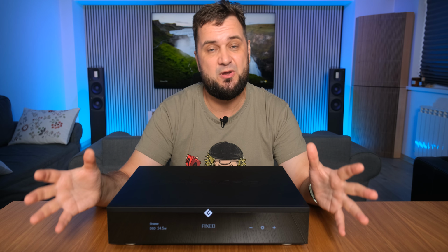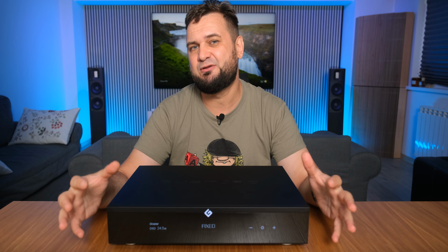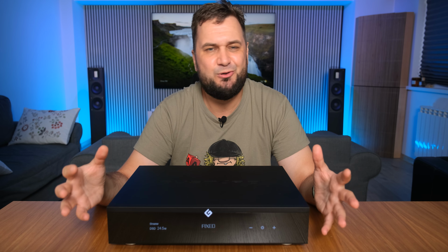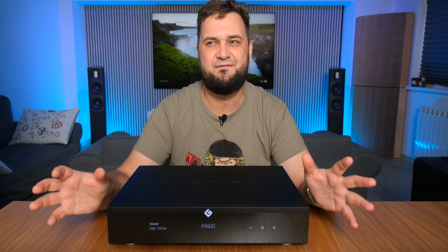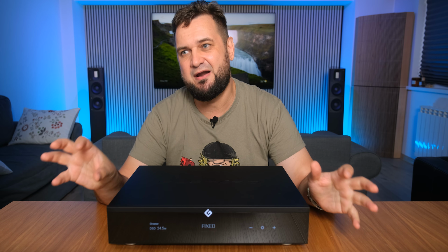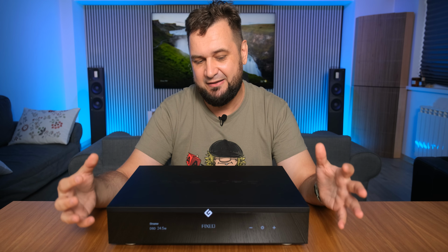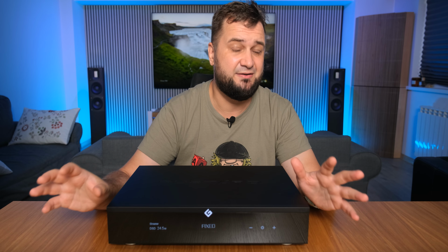While we're still dealing with an oversampling Delta Sigma DAC, which is the X30, don't forget that we have custom digital filters, we have a non-oversampling mode, and once you engage those, it will no longer sound like a Delta Sigma DAC or like an ESS Sabre DAC, but more like a very technical R2R ladder DAC. And it's a very rare thing to call an ESS Sabre DAC as organic and as natural or real sounding, but X30 is that kind of breed. So this one is actually very different.